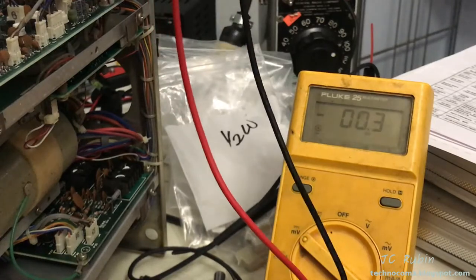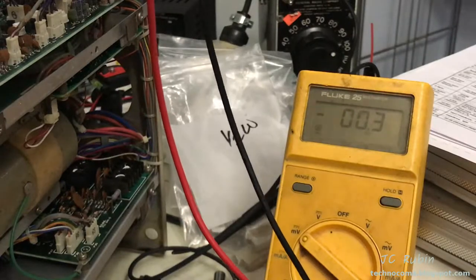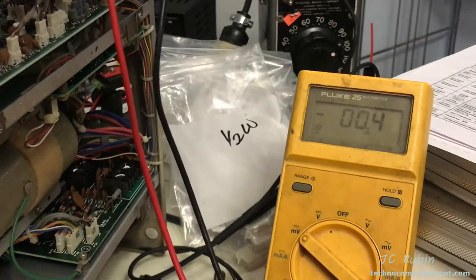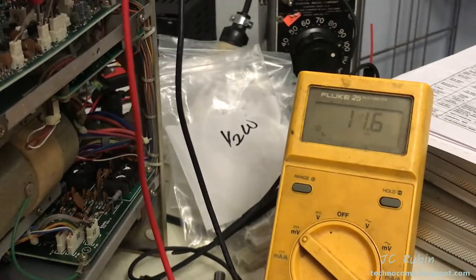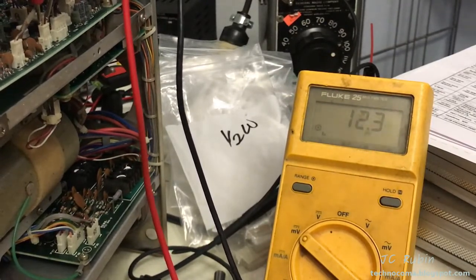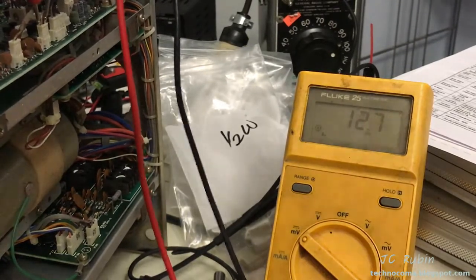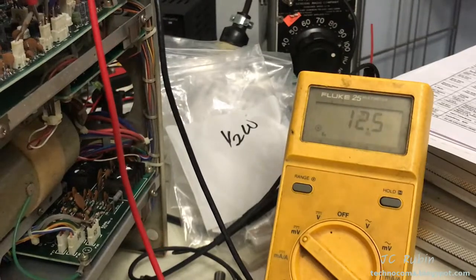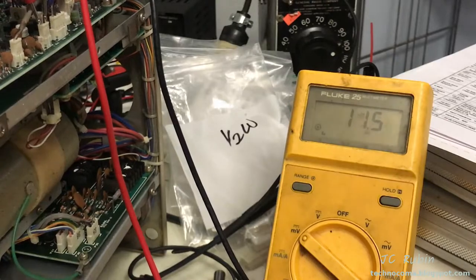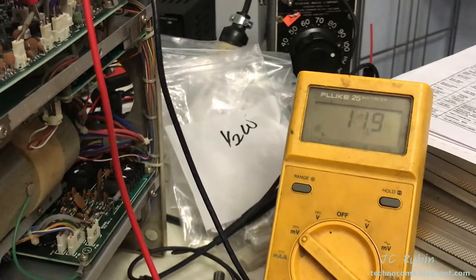To demonstrate how this works, I'm going to use channel one to test it — I'm not going to test all four on camera, that'd be ludicrous. For channel one, the connector port to test is pin 15. I'm set on millivolts and I'm testing pin 15 here. You can see it's showing 11 millivolts, showing 12 millivolts, but this is relative to exactly how centered channel one is. I found it's easier to move the others out of the way and do them one at a time.